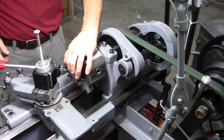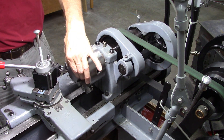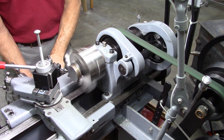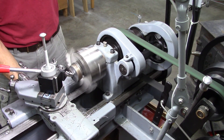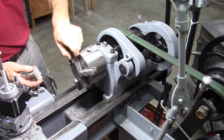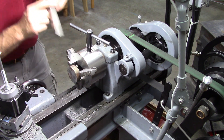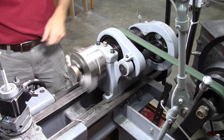I've got a piece of two and a quarter inch stock in my chuck. I did my best to make it straight — it was rough cut on both sides, so it's just kind of a feel thing. I think it's fairly straight, but I'm going to face one surface of that. Now I'm going to put a spacer bar in my chuck, flip it over. This bar is just to make sure it's square in there — it doesn't have to be perfect, just close. It looks straight on the back side.